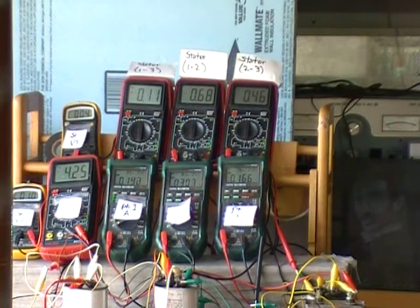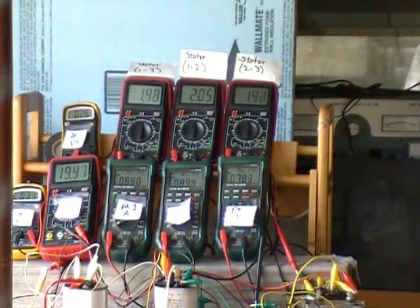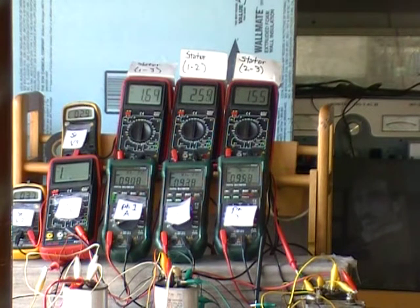What we're going to do then is observe that ratio now when the 5-volt field is employed. Now we see that the ratios have totally changed. We have near 2 amps on the left stator line 1-3, and we got 2.8 or 3. So we got 2/3 the amount in the center now. Before we had 6 times the amount. And then the actions of current delivery on the phases, they're all showing themselves near 1 amp on this functioning. Now that means then, of course, since those ratios have changed, our voltage ratios on the other side should have changed.